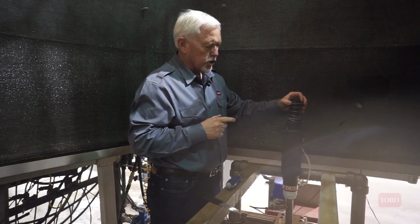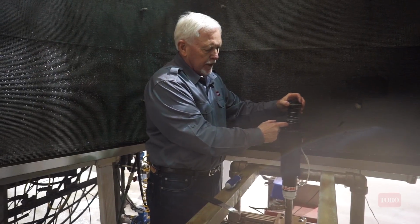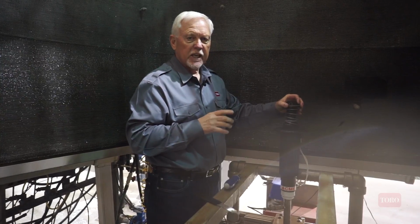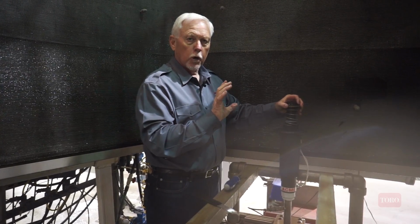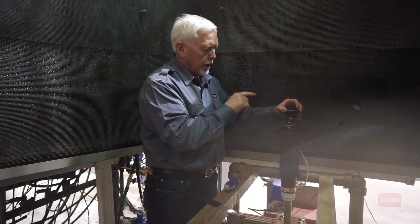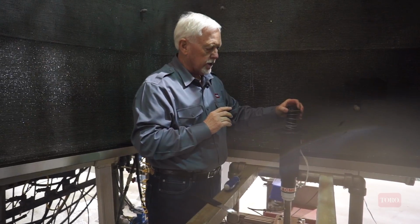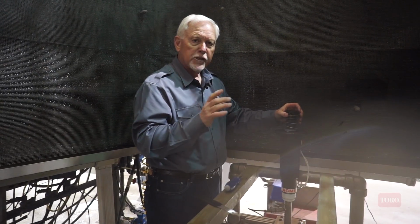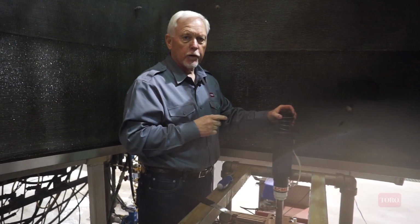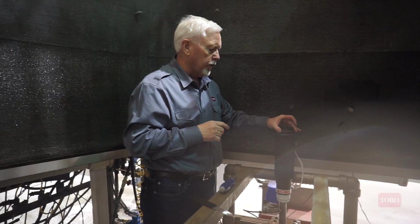Now, just a point with this. The amount of distance between those ribs on the Rainbird sprinkler is about 16 degrees. So if you are looking to have a very fine left arc position, the finest that you can make that adjustment is 16 degrees. On the Toro ratcheting riser, every ratchet position is 2 degrees. So you can get those ends of arc positions much finer on the Toro sprinkler.